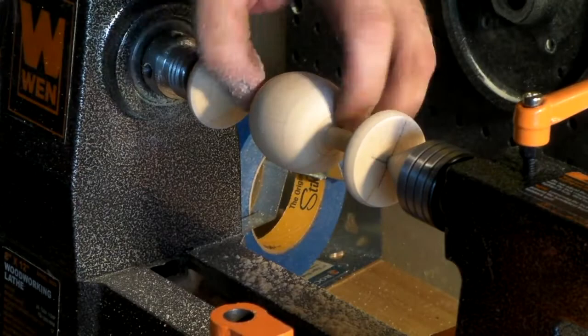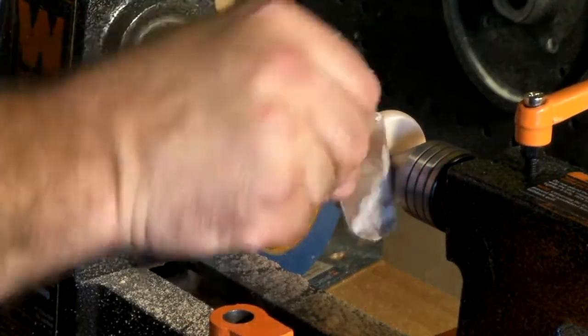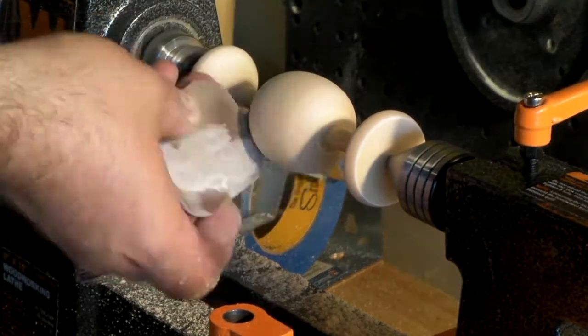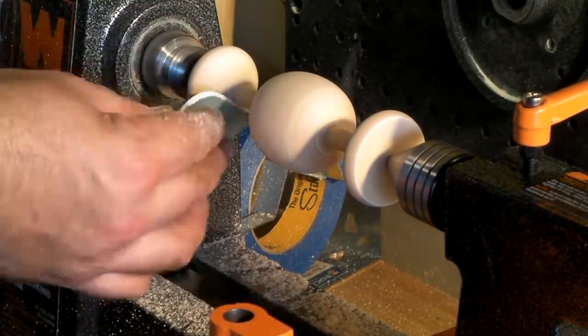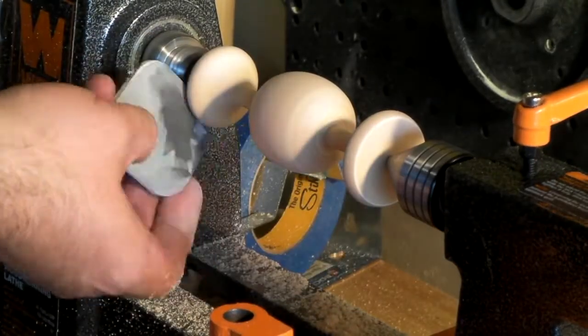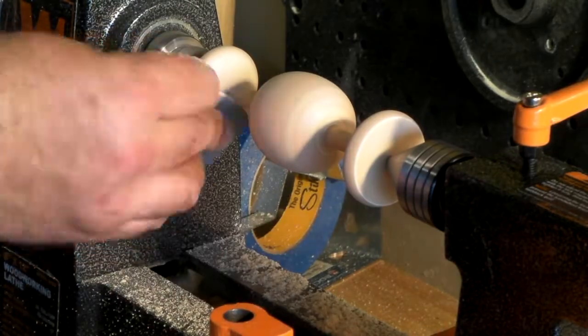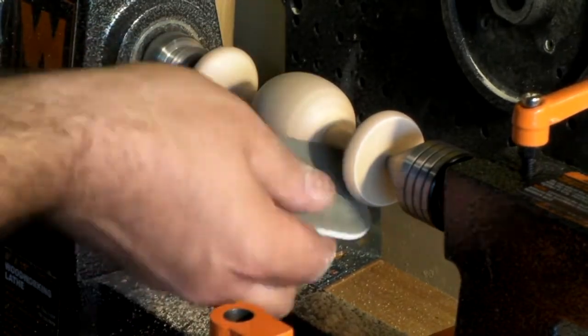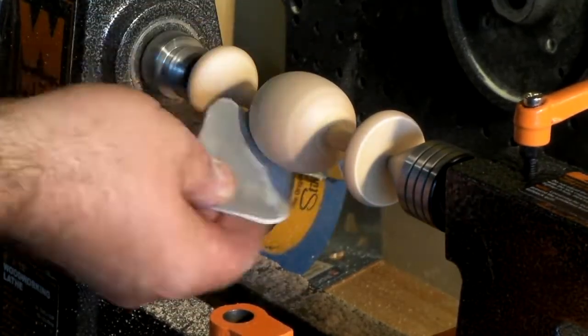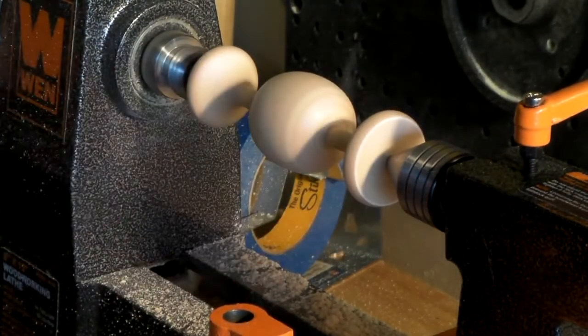And it's pretty cool. Now I'm going to go ahead and hit it with some sanding sponges. I skipped over a bunch of the sanding strips there. But fast forwarding here to sanding sponges, let's jump ahead again to our higher grit, knocking all this down and putting a really nice finish shine. Basswood doesn't have a ton of grain within the wood, but it will have a really beautiful natural wood luster. And as I started doing this, it really started to pop and come out here.